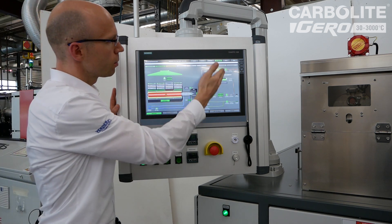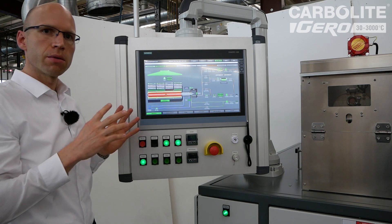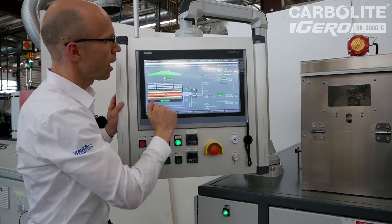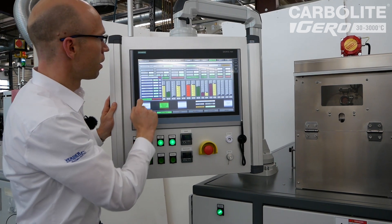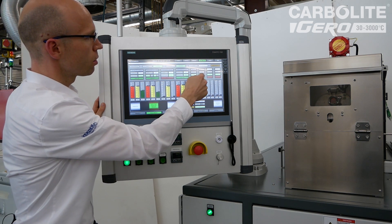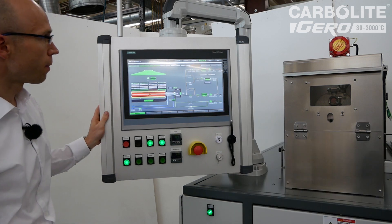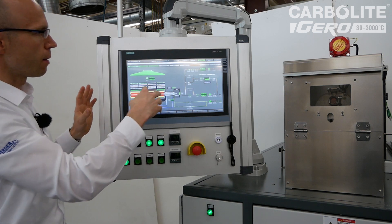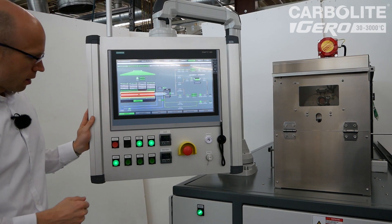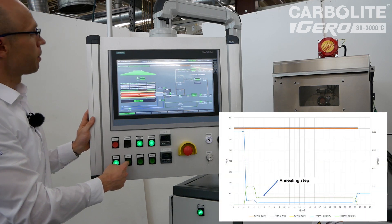For one minute we have a very high flow of hydrogen and nitrogen to ensure we really have the starting atmosphere we want as soon as possible. To be more efficient with gas usage afterwards, you can reduce the hydrogen, but at the start you want to be sure you have the correct mixture. For the pre-flooding we have a total of 600 liters per hour, then we reduce to 500 liters per hour — 400 liters hydrogen and 100 liters nitrogen per hour. The flow is then reduced to what the customer wants for the heat treatment.